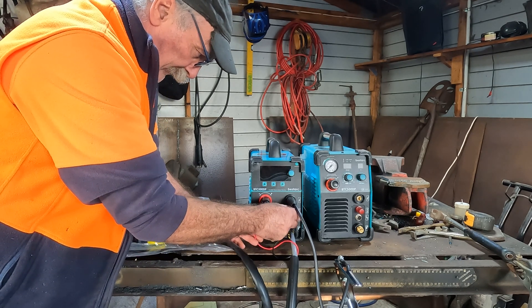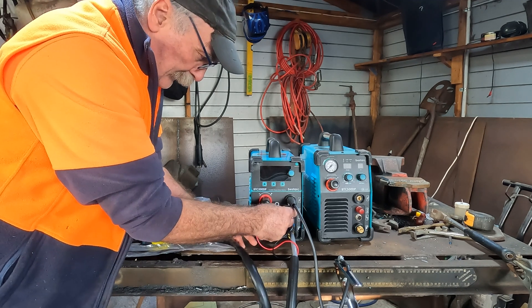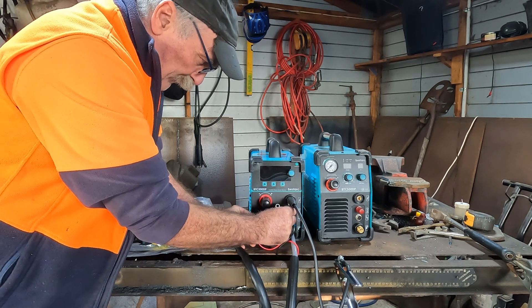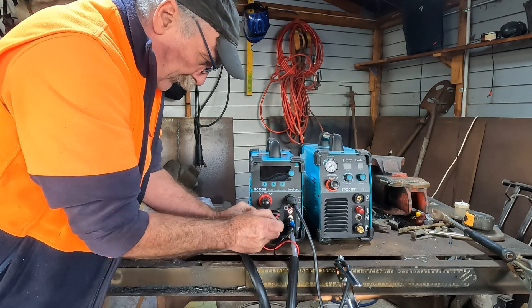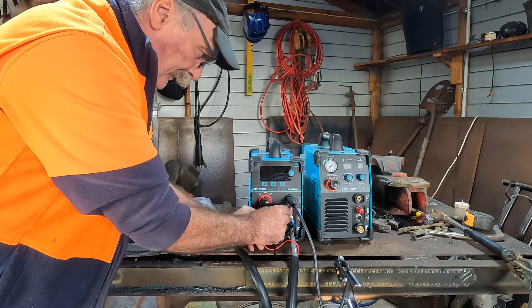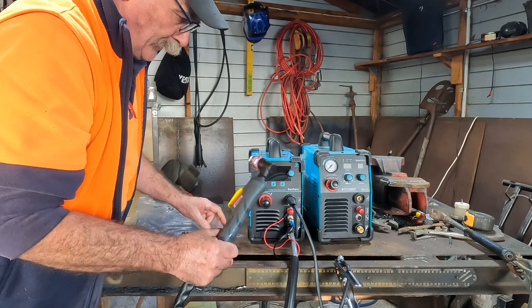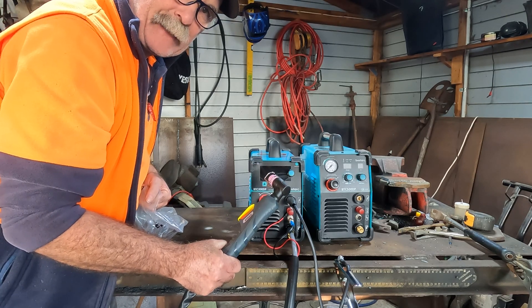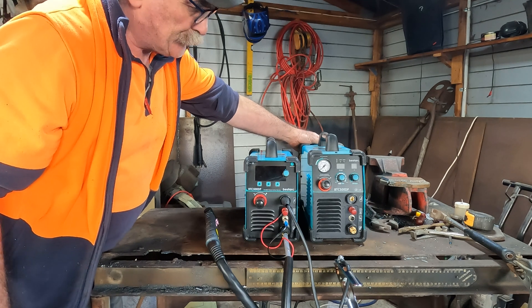Especially the pilot arc wire, because sometimes it can vibrate and burn out the little socket. So take that off - this one has two washers on it - put the wire in between the two washers so you've got a good clamp so it doesn't vibrate. And just like that, we're out of the box and we're ready to cut.